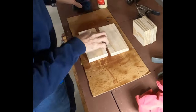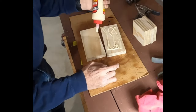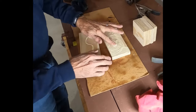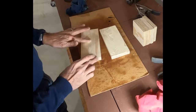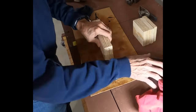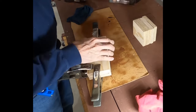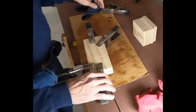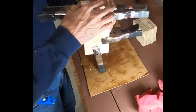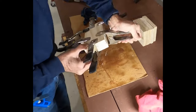Next is starting to do the glue up. The first thing we're going to glue up is that eight inch backboard. What I'm doing is sandwiching two three-quarter inch pieces of plywood together, just using some wood glue and some clamps to hold them together. It did move around a little bit. I've seen some people use salt or sawdust on there — I might try that in the future. The little spring clamps tended to wiggle around a little too much, so I need to try something better next time, but this did work for what I needed.